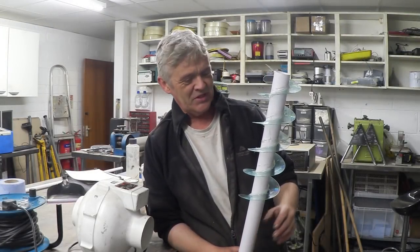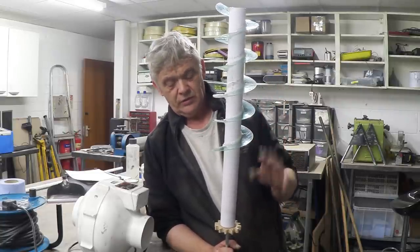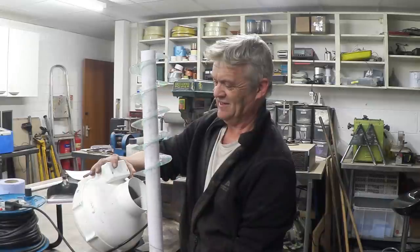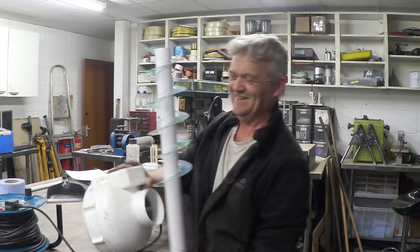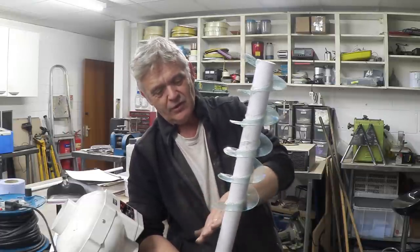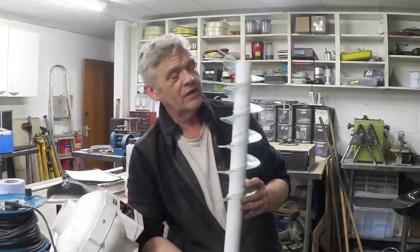Okay so this is clearly turning into a bit of a mission. I wanted to quickly test something — I've put a bearing at the bottom and a little stick to hold it. I took it out in the wind and it doesn't particularly turn in the wind. However if I put a blower that blows up through these vanes — I mean, not earth shattering as a wind turbine, but it is telling me that that pitch really is looking really good for fluid flow across it. The air was kind of angled here catching the vane and making it spin a little bit. The idea is you put it in a pipe and have the water flowing over it — air is compressible and this is going absolutely everywhere, but with water and a bit of weight on that, we should be able to get that to generate quite well.